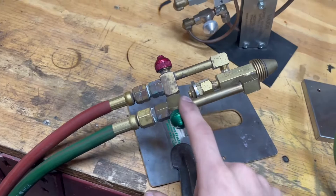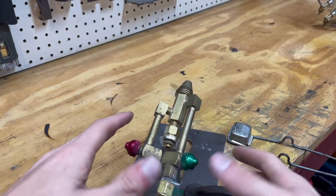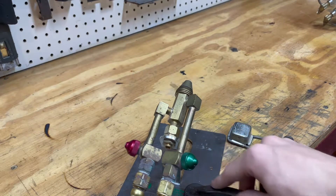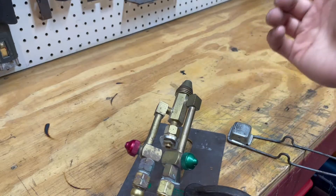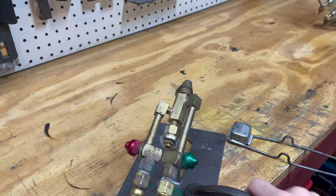This is the one that I've plumbed up so we'll be taking a look at this one. I have the view set up so you can see it how you normally would with your facing on and then you'd work with the glass here. It's important to remember when working with your torches to have them nice and secure and clamped down, because you don't want something hot with a giant flame coming off your bench and melting your leg. I just have a basic C-clamp and it's nice and fixed to the bench.